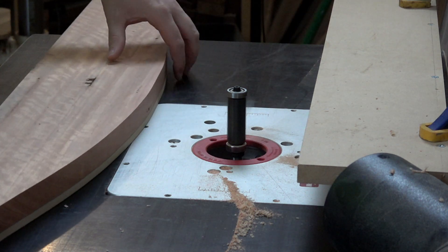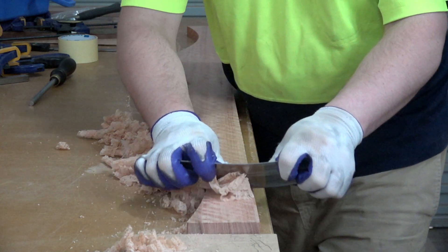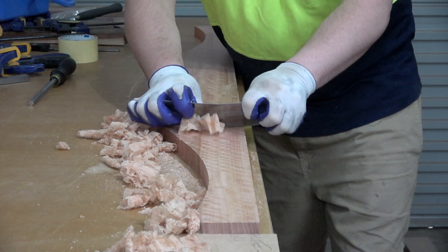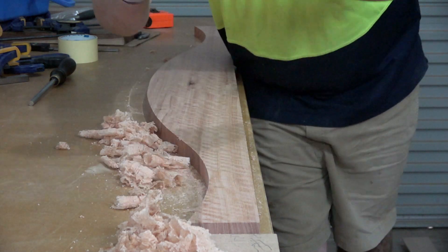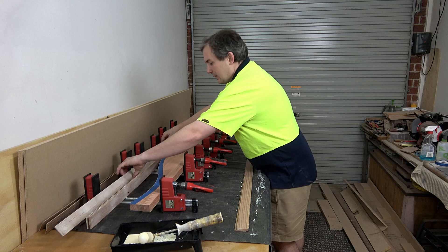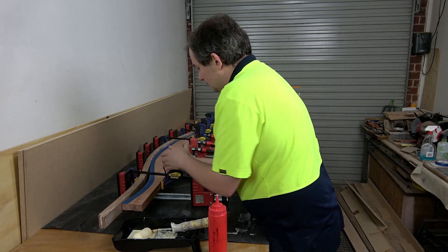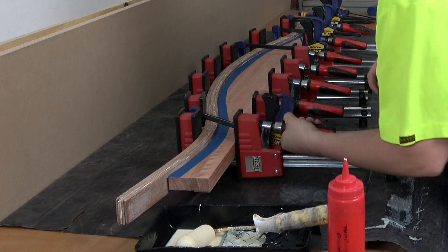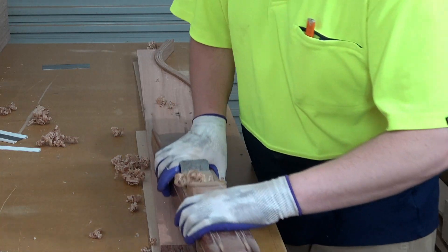As you can see it's another nice piece of grey gum. I milled some Tassie oak into three millimetre strips to use as a bent lamination to cap off the header panel. This capping used seven layers to create a 21 millimetre thick capping, and I glued it up on the original. I left the bent lamination clamps for about three days, just to be sure that the glue had properly cured to maximum strength.